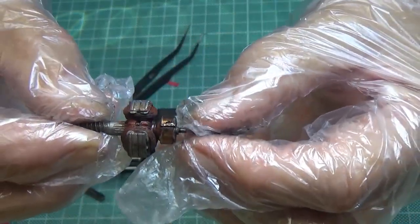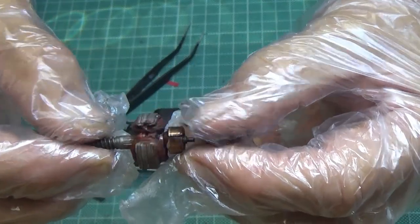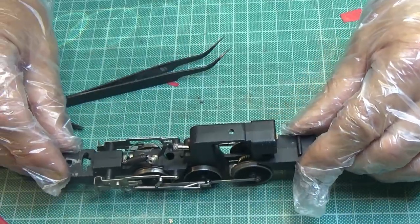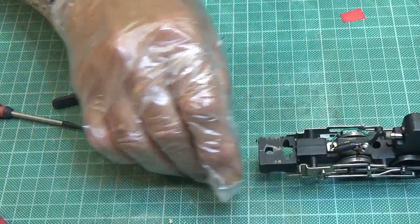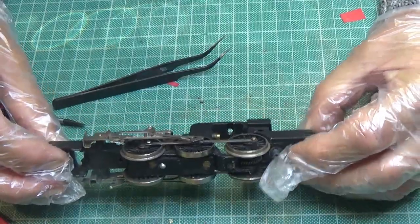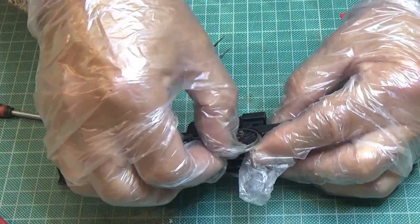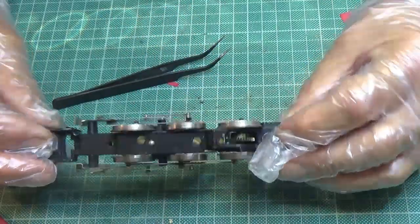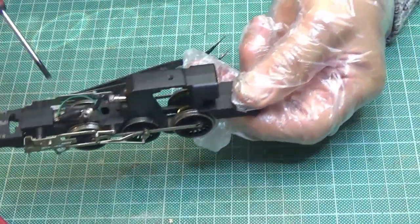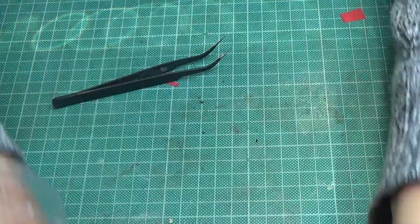Commutator plates look relatively clean but undamaged. Still some grime there, but I could easily clean it off, and I'll check the windings very soon. Now that I can do that, I should be able to check the mechanism, and that runs very, very smoothly. So, a clean up and a bit of lubrication at relevant points, and that should be ready to go. Tarnishment there. So let's leave that aside. Just before I do, down in the bottom bearing, I can make out another ball bearing. So again, I don't want to lose that.